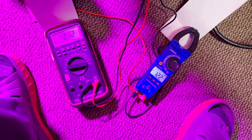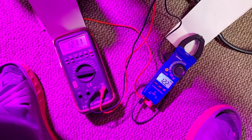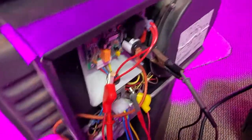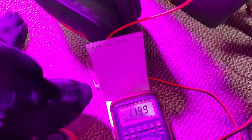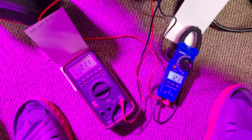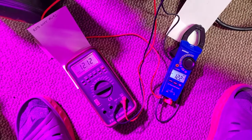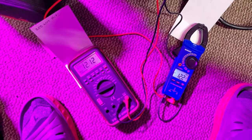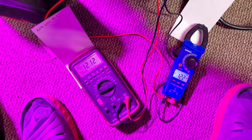The overheat temperature switch may have gotten hot and just never went back and closed. We're going to keep doing it and it's going to say it can't fire up. You can hear the fan running. Blue wire is that meter, red wire is that meter. Pretty soon it's going to figure out it can't fire up and it's going to shut down the gas valve, then purge all that propane out of there for safety. Hence the brown circuit.